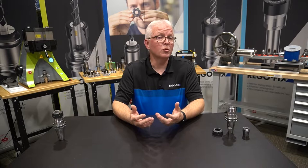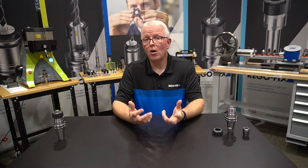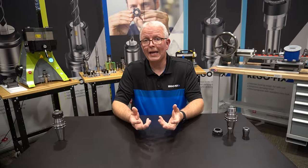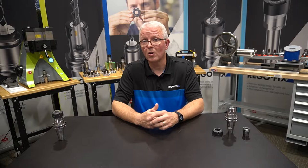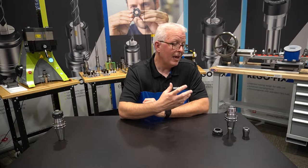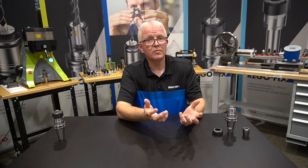As in most cases, when you do a tool disassembly, you don't always have time to clean everything. Sometimes that collet may get a quick wipe down with a rag. Sometimes it's just immediately reused and the tool put back in because that machine is waiting to have that tool put back in place and start manufacturing. But what happens to your clamping force? Today we're going to compare a clean assembly versus one where the collet has dried coolant on it. What happens? What are the results?